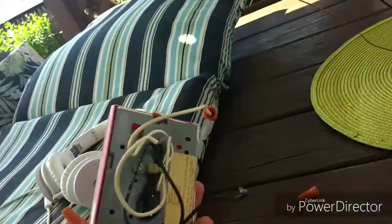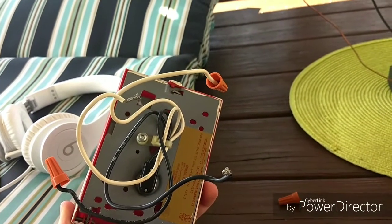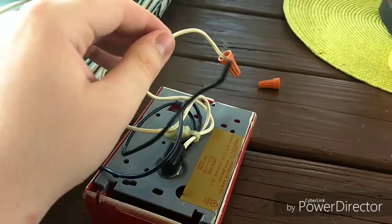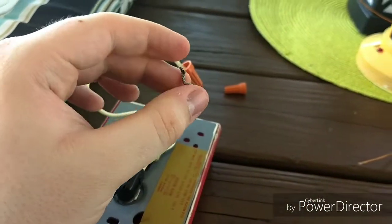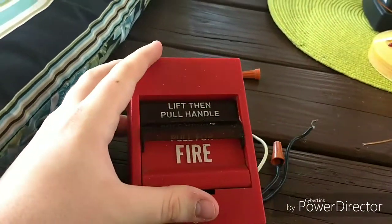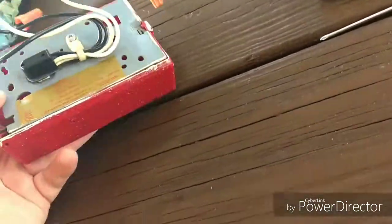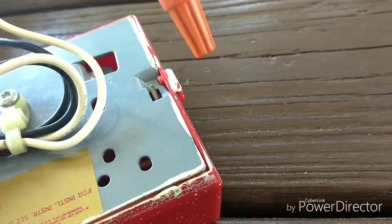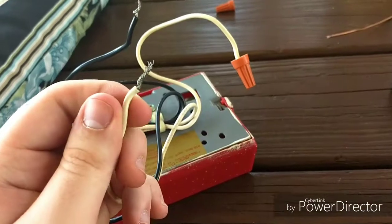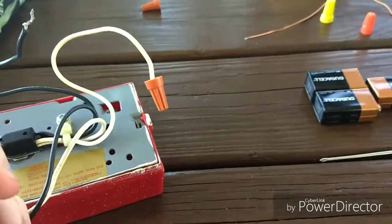Now that everything is apart, I'm going to explain what you need to do. If you have a four-wire pull station with wire leads like this, you will want to put wire nuts on the other existing wires. You will only need one of the white wires and one of the black wires — whichever color you need, just one of each. If you just have a two-wire pull station or a pull station with two terminals on it, that will also work. Pull stations with wire leads can be a bit tricky because you may need to use wire nuts if you don't have alligator clips. An alligator clip is essentially a wire with a little mouth on the end that you put around the wire and it bites down to secure a connection without needing a wire nut.